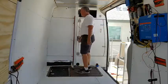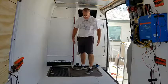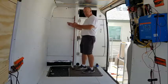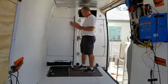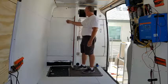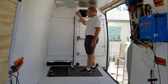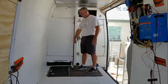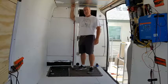The shower curtain has to surround the person standing over the slats that drain down into the drain. This section is left open because there's going to be a cabinet on top, and I wanted to make sure it has enough airflow to breathe and dry out — about two inches between the cabinet and the bulkhead. The track starts in the back corner, jogs past the three-inch aluminum pole, and comes all the way around 360 degrees, with the opening in the corner. We need to reinforce the ceiling here to tie that track in.